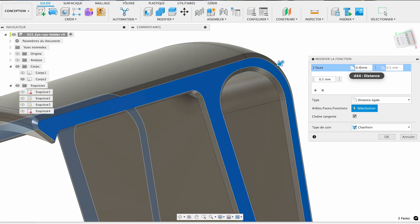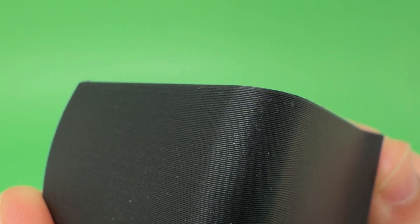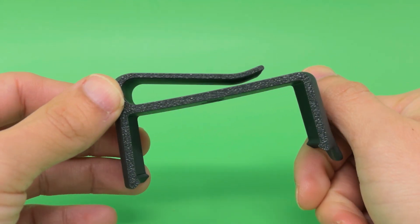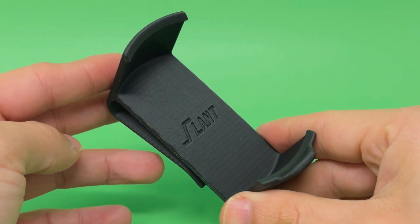Now all you have to do is design this. One of the subtle tweaks: make sure you chamfer the bottom layer so you don't have to worry about elephant footing anywhere on it. And on the top layer, if you're being clever, rather than having flat sides, you might curve all the edges so it doesn't look like a single flat top anywhere. This is a really simple way to improve the quality of the part. You can mass produce these very easily — a part like this is very easy to produce both on demand and in mass production, very affordably.